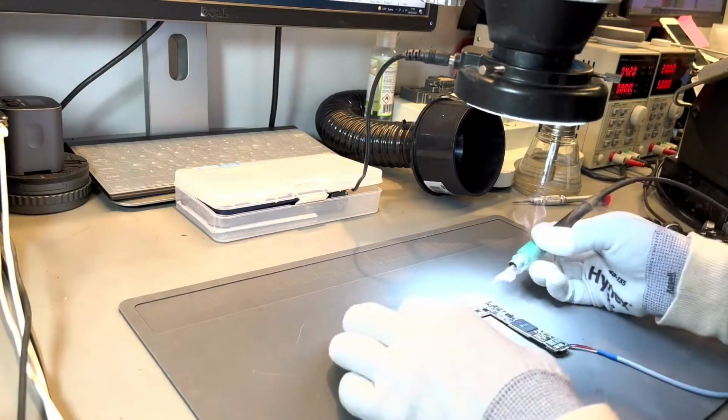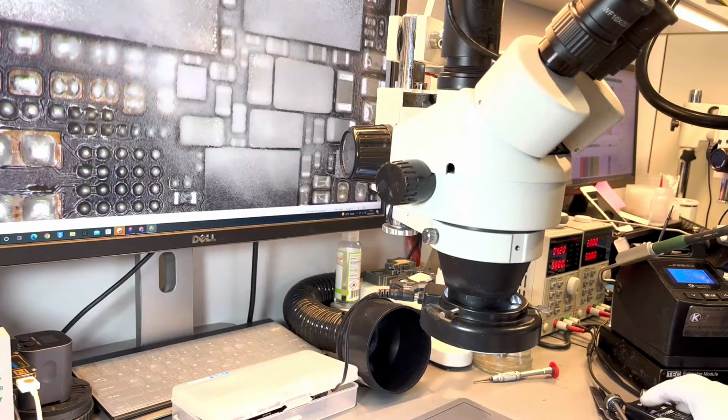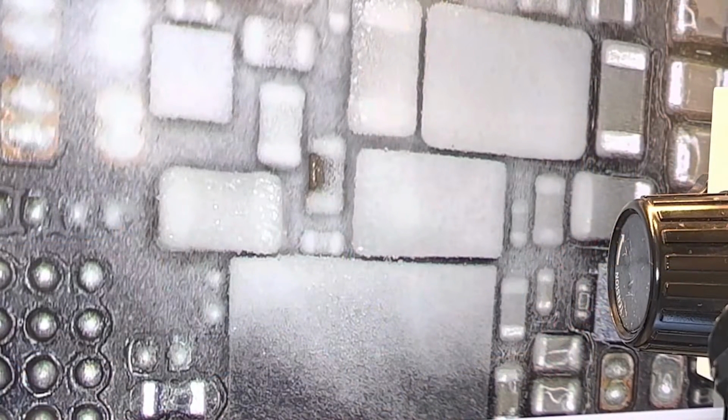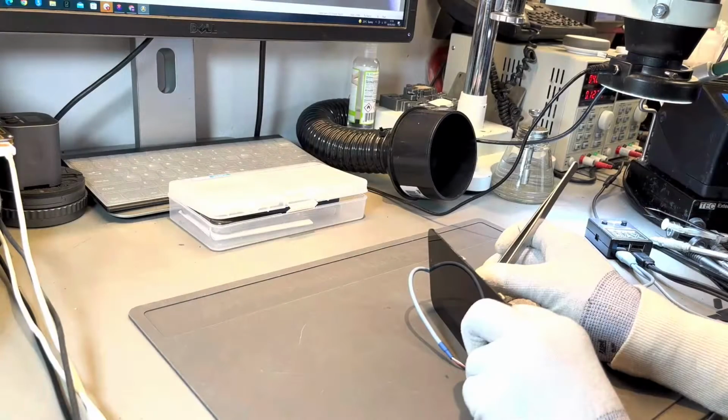We dust off the iPhone's logic board with rosin, and that's a product from tree sap to help us locate the fault. Inject power again using the direct current machine and find this tiny, small, single capacitor that's consuming power. That consumption of power is what is producing the heat and is stopping the iPhone from turning on.